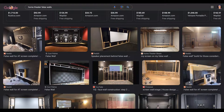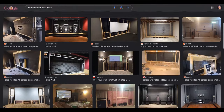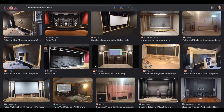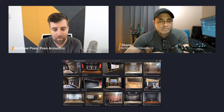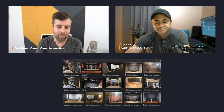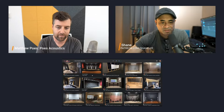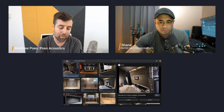The false wall approach is nice because you can put anything in there, but you don't eliminate SBIR. You actually get a fairly substantial 6 dB gain from a baffle wall that you can't get from a false wall installation. With a baffle wall, it has to be tight right up against the baffle of the speaker so it can extend it — like a cutout for the speakers in the wall. Technically, an in-wall speaker mounted in a partial wall is effectively a baffle wall installation.